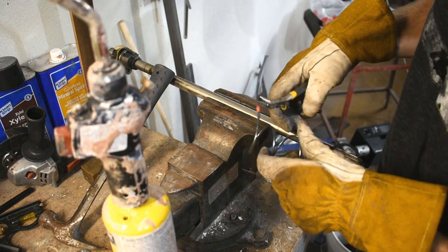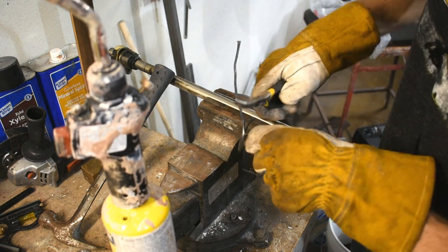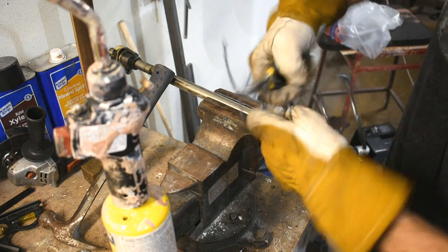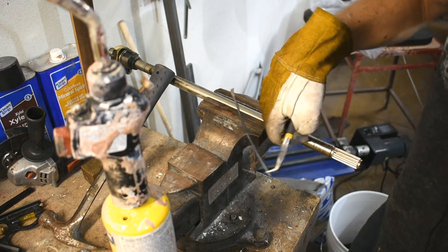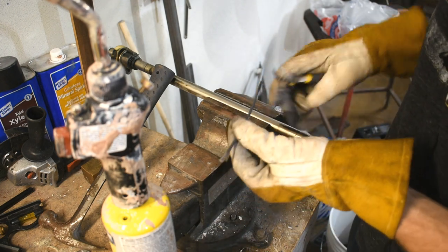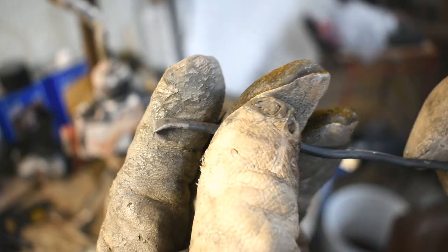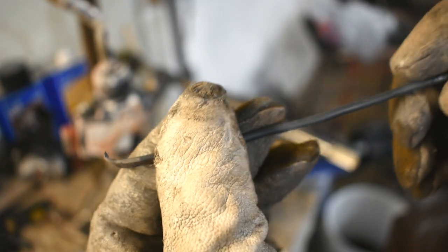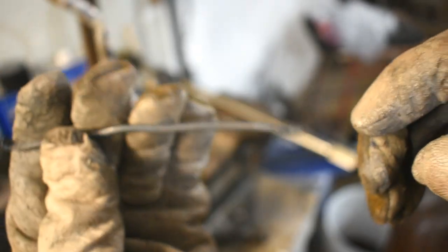Yes, I have a little cup of water to quench it. From what I've heard - correct me in the comments if I'm wrong - if you heat up metal really, really hot and then quench it quickly, it hardens it but makes it a little more brittle. I'm okay with that - I care more that this thing doesn't straighten out as soon as I put some load on it. It's still a hook. I think that's good enough. There - got my little hook, gasket-pulling hook. It's short, it'll just fit right in the toolbox. Small and dark, which means I will lose it immediately. Perfect.